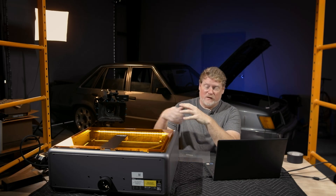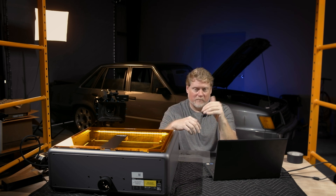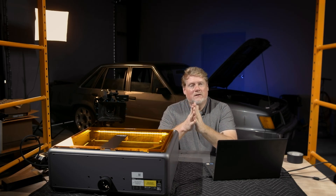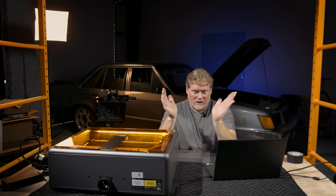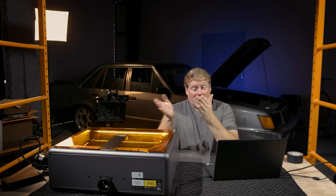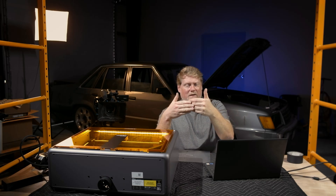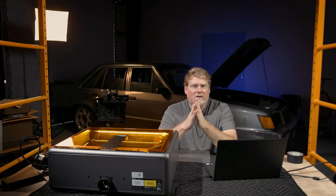The size this thing can cut is big enough to do the LTD's intake manifold gasket between the upper and lower intakes, but not big enough to do the intake manifold to head interface gasket. You could do that in two pieces, which is actually really nice — because I tend to buy different thicknesses of intake manifold gaskets to get a perfect port alignment. You can cut a puzzle piece that's two pieces interfacing with each other between the bolt locations.